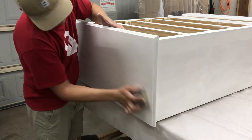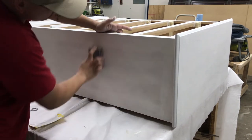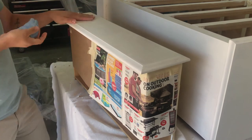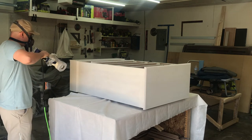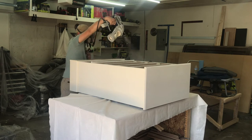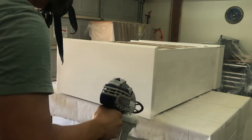Since I'm still pretty new to shellac, the primer didn't come out as smooth as I wanted. I just used 220 grit sandpaper to lightly sand it and smooth it out. I then did the same with the drawer faces. I just got this new sprayer and this was my third time ever using it — it was my first time spraying a dresser and I was a little nervous. I locked in the settings off camera and succeeded in spraying two coats of cabinet grade paint. I used an off white color. This sprayer made painting the dresser a lot faster and delivered a smooth finish.